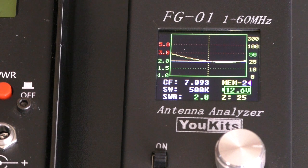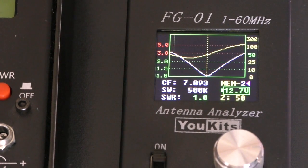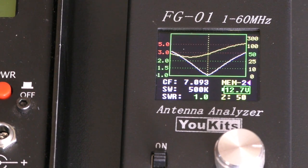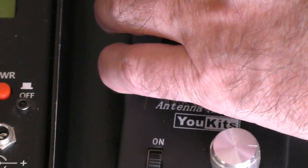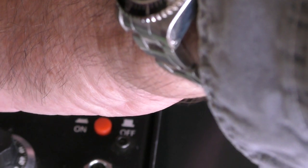Now the SWR is 2 and the impedance is 25 ohms. Now what this doesn't do — I'll put the ATU, the antenna tuning unit, back in — so now it's got a match the transmitter will like, about SWR of 1, impedance of 50 ohms. What this doesn't show you is the reactance in the antenna. It shows impedance and SWR but not reactance. What the guys do in broadcasting is — they're only dealing with one frequency — but if they're matching a mast for AM broadcasting, they'll put an antenna analyser on there and it'll show the reactance, whether it's inductive or capacitive, and they'll calculate a value to counteract that.